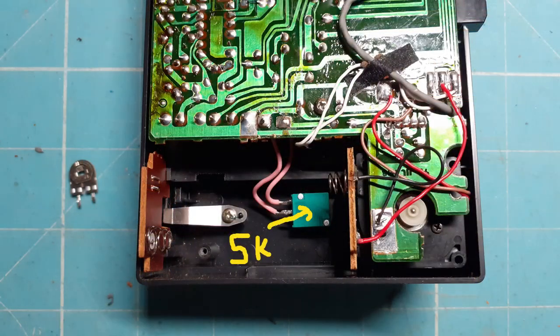I played around with a few values of potentiometer, which is a good idea because all these circuits will vary to some extent. The one I landed on was a 5k pot. I used a small 9mm pot because it was small enough to fit in just behind the battery case and still get everything back together and screw tight. So that's pretty much all I did — I replaced that preset with a 5k pot, screwed the case back together, put a knob on it, and hey presto, we have speed control.